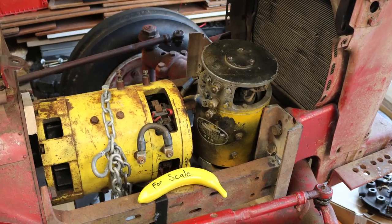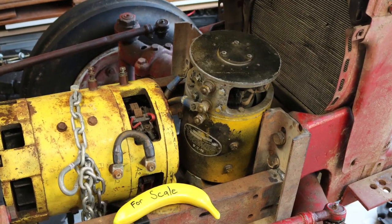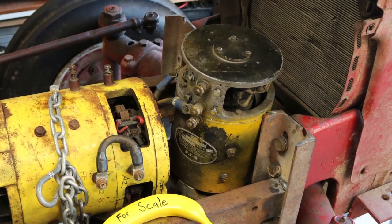At this point my only concern is being able to mount the electric motor so that the flywheel is properly supported — that's probably going to mean adding a bearing in here, and it might mean pushing the electric motor back from the tractor a little bit. I still want to make sure I have enough space in there to squeeze in an electric hydraulic pump, since we're not going to have an engine-driven pump. I have a hydraulic pump motor I want to fit in there, and it should fit fine as long as I don't have to move the drive motor back too far.